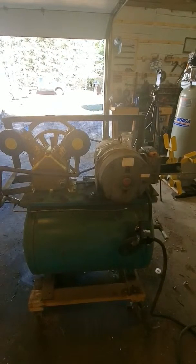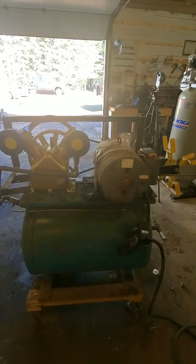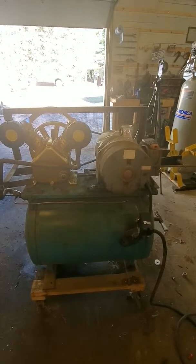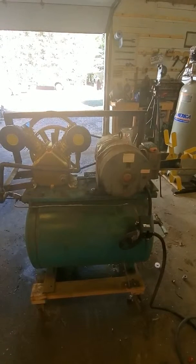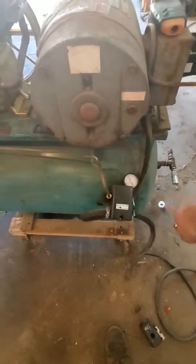I'm planning on spinning it up a little bit because there's a lot of sandblasting coming up, so I figured I might as well spin it up and get the air output it's supposed to be doing. I just had to replace the pressure switch — I finally burnt my contacts up after two years.